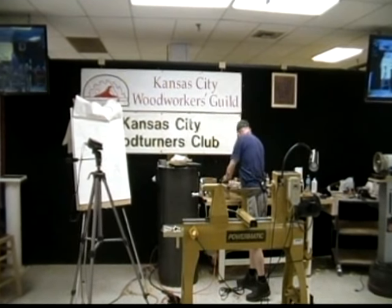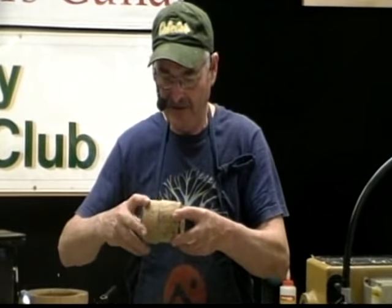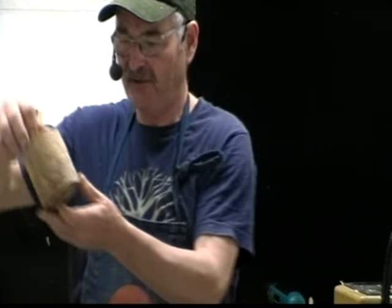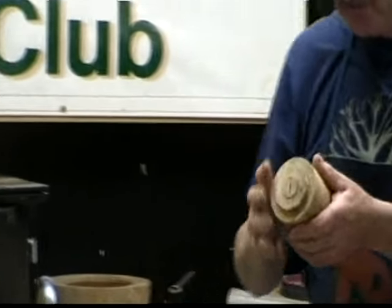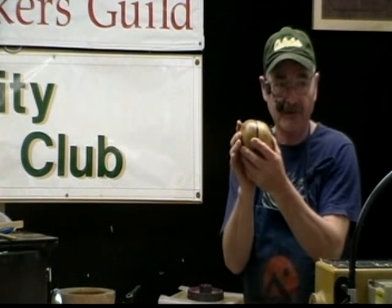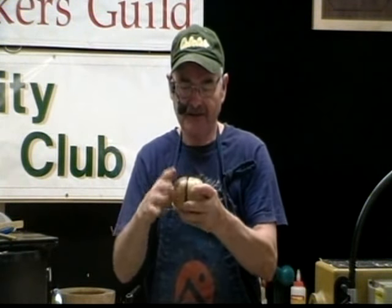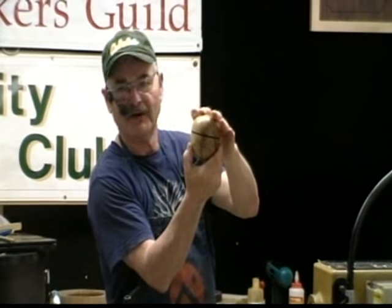Real crooked grain wood, like, for instance, stuff like that. You see the way the grain matches in that? Now that's punky wood. And you could get burl or crotch or any of those crooked grain woods. So the project is designed in such a way that when you part off the top from the body, whatever width of wood you lose, you replace it with exactly the same width of a contrasting wood. And that means that when you twist it around, your grain matches always, see?